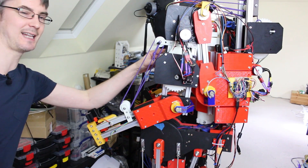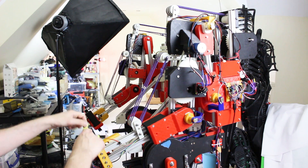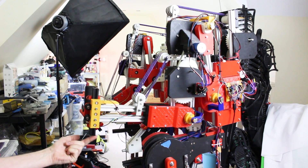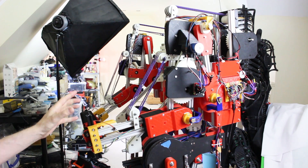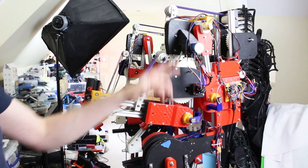We also need to incorporate the slackness sensor. When I lift the arm with no load, the strings start to fall off the pulleys. So I look at the tensioner value: if it's less than a certain threshold when the string is slack, I set the tensioner value to 300, which gets added to the wrist_mix and to 1500, making the motor run fairly fast to take up the slack. If it's not slack, it's zero and has no effect. I tried making this proportional based on the hall effect sensor, but the idler mechanics are jittery. It does pull the string up, and hopefully when there's a load on the arm it won't rely on this much — it's mainly to stop the strings falling off the pulleys.